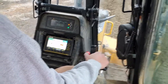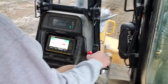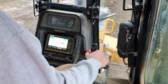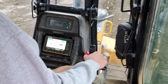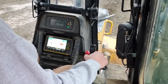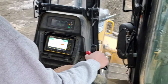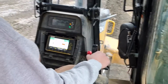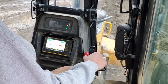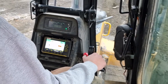Well, once we get all the subgrade put in, the engineers will survey it. Should happen this afternoon. Then we put in 18 inches of clay liner. So hopefully we can get rid of all this mud and have a decent surface to work off of, and start placing the clay liner. If all things go well, we can start on that tomorrow. But there's a lot to get done before we can start that.